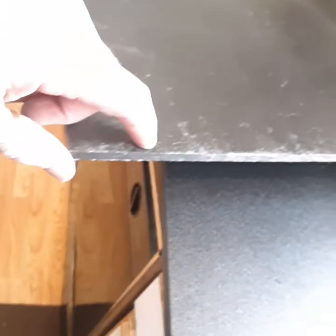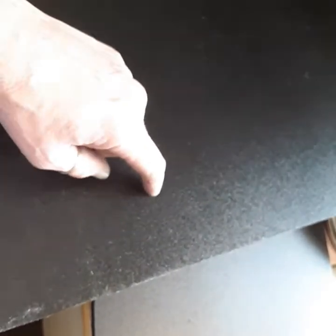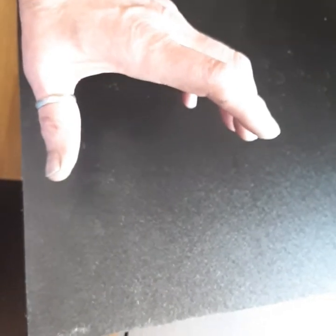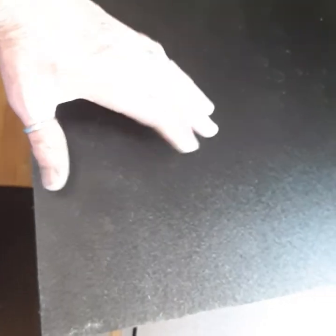And I picked up this other piece of 1/4 inch HDPE. It's a bigger chunk because they recommend that I use a 1/4 inch plywood on 2 sides with a block of wood in it, and this goes around the mast step on the coach roof. It's used for that tabernacle fitting where the mast tilts up, and I didn't like the idea of using plywood, so I bought some marine-grade 1/4 inch HDPE. This is going to last forever, and I won't have to worry about that. So this is a piece that I'm going to cut to fit that, and then I will have some of this 1/4 inch laying around to use for projects.